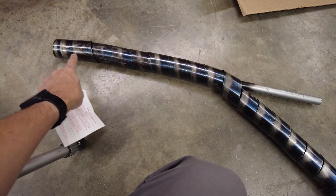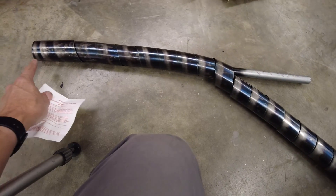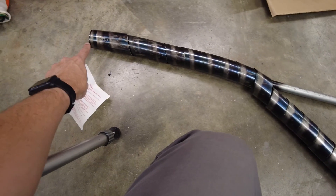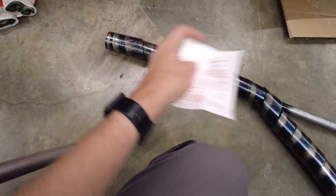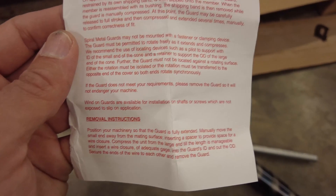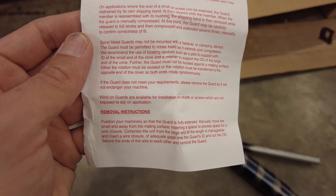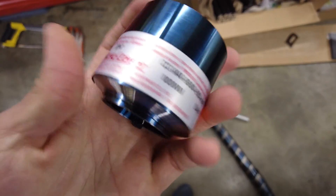I practiced with the old spiral metal spring first from the milling machine that came off of it, to see if I could let it extend and then coil it on very carefully. And I believe I can after practicing with this. The instructions that came with the spring itself do say that this is an over-end type spring. Wind-on guards are available for installation on shafts or screws which are not exposed to slip-on applications, so the wind-on would actually be a lot nicer to use.